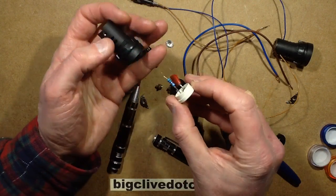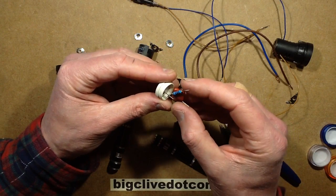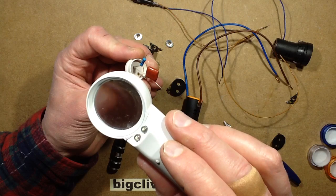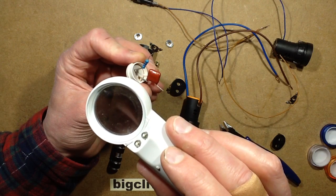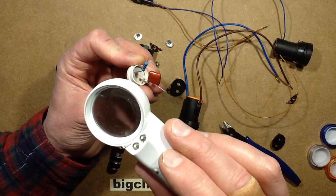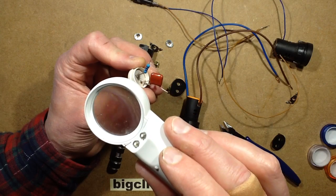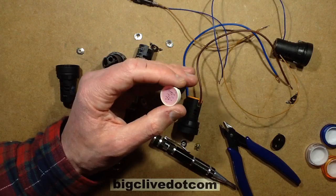So what have we got here? Got the 1K resistor again. And the capacitor is rated rather vaguely, it's not very clear. 100 nano. It says 104K250. Surely that's not the voltage rating. I hope not. 104K250 NISC91. Is that a 250 volt capacitor in a 380 volt indicator?